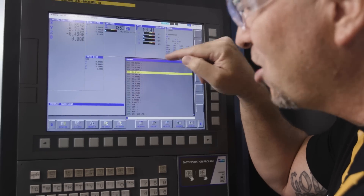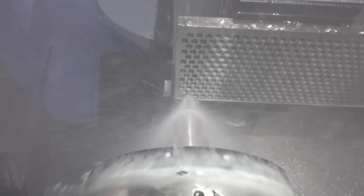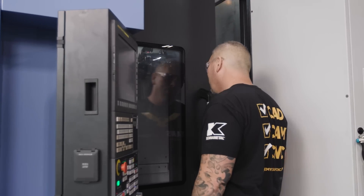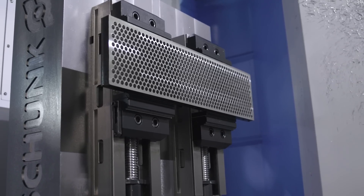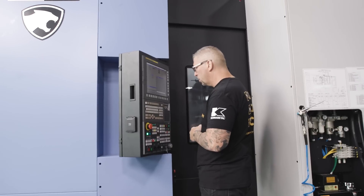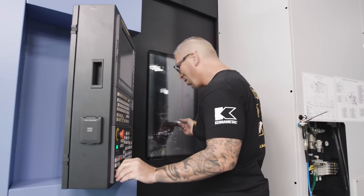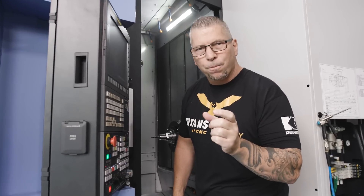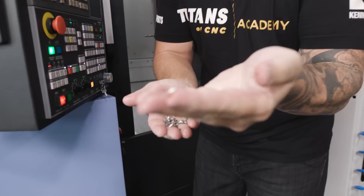Check this out — 665 holes coming to an end right here. Fingers on the button, because that's my nature. Check out all those holes — incredible. The block insert, boom — that's going to take the tool and bring it right over here. I've got to make sure I don't crush this camera. Almost crashed it! Look at that — we went through an inch of material and did 665 holes at an incredible feed rate. Now look at how small those chips are.